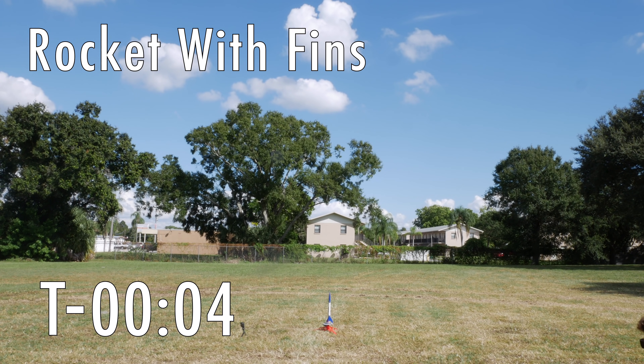However, adding fins isn't the only way to do this. Bottle rockets, for instance, have those long sticks that bring the center of pressure behind the center of gravity, making them stable, like the rockets. So now let's do a little test. Here I have two identical rockets — except this one has fins, and this one doesn't. I know you want to see the rockets launch, so we'll do that first, and then we can calculate the center of pressure and the center of gravity to understand what happened.